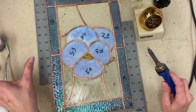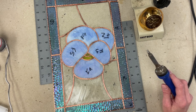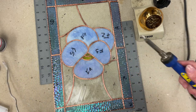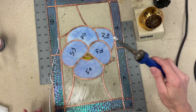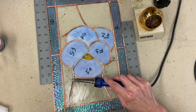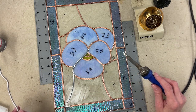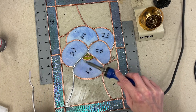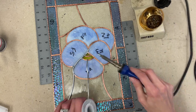I've got my piece all fluxed — I used a paste flux. There are also liquid and gel fluxes, which will be another video. Now that my piece is fluxed and my iron is nicely tinned, watch how well the solder flows. The foil has been stored in a plastic bag so it has very little oxidation. If you see any black particles, that's oxidation — wipe that off and continue.